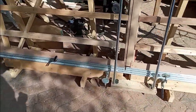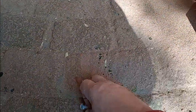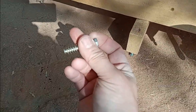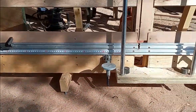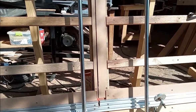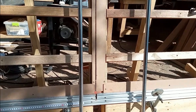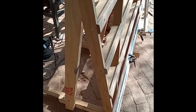All the feet — four at the front and four at the back — have one of these set into the base. This is an M8 threaded insert that you can get from Hafele. I put these in underneath together with an M8 bolt so it can be adjusted. The whole framework can be adjusted because if you don't get it level, sometimes the movement along those bars is a bit restricted. I gave the framework a basic apron so it can stand up and then go anywhere you want.